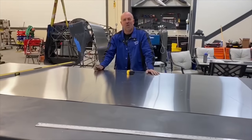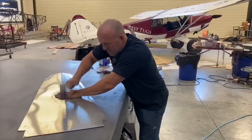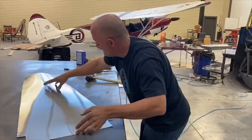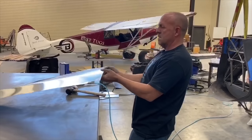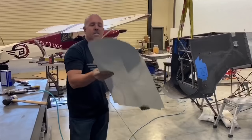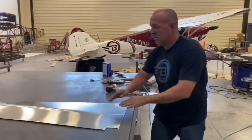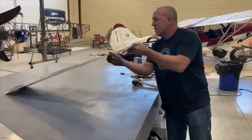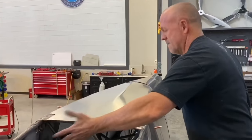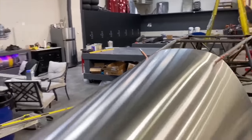Trying to make a giant mold of the entire fuselage so it's round instead of a more square carbon cut. Transitioning the part from round to flat - first I put the arc in it and creased it the entire length, and then you can set it back on a flat table and slowly pound the crease back out of it, so it's actually perfect. This is going on the belly of the plane - we'll carbon it and then throw the mold in the trash.